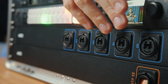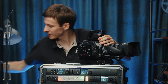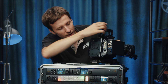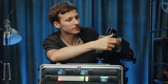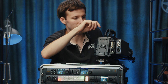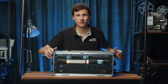If you're wondering how we convert the fibers to the cameras — for example with an Ursa broadcast — we put here a fiber camera box that goes like this. We have the SDI in and out that connects to the camera, and on the other side the fiber connection for the cable that just goes from here to there. Since it is fiber, it can be 50 meters, but it can also be 600 meters or 2 kilometers if you need. So that's it for the front.